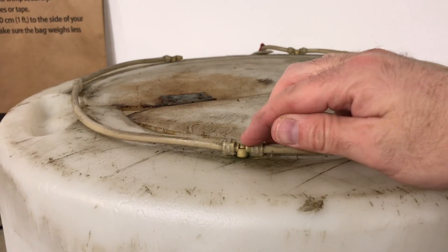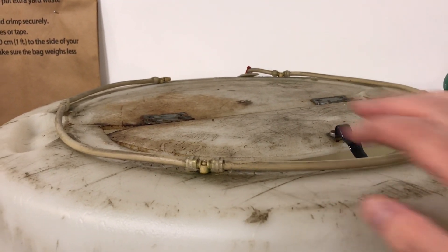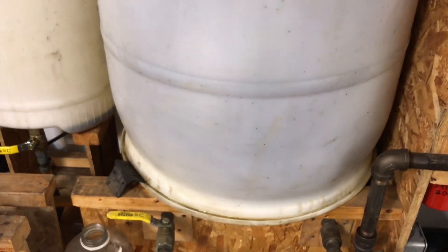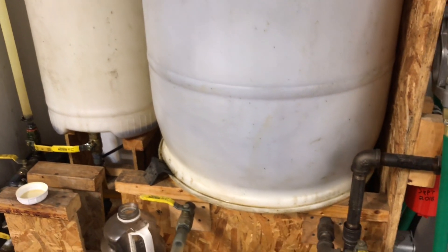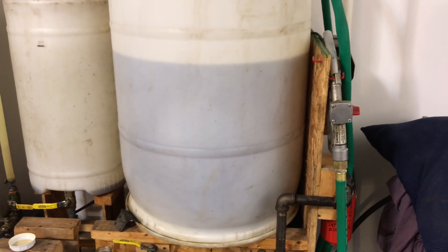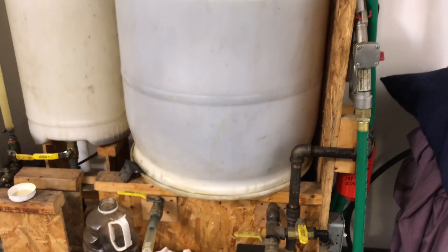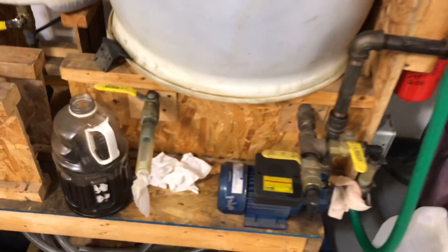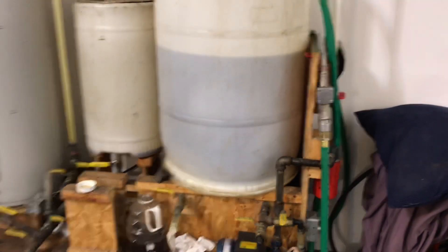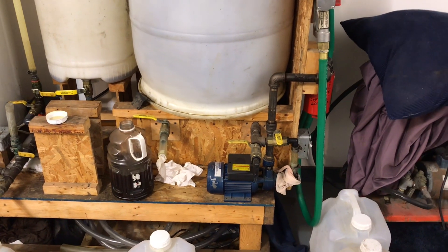I use these little Arizona misters with a standard hose connection at the back of the machine where you can hook a garden hose up and mist water. Those little water droplets pass through the biodiesel and, because water is heavier than oil, they pick up contaminants — trace elements of soap, methanol, glycerin — and the water settles to the bottom. At that point you use the bottom port to pour off the dirty wash water. I don't use that anymore — it's a bit messy because then you have oily, soapy, chemically contaminated water to dispose of.